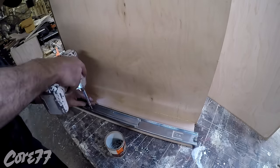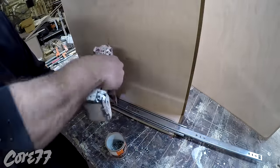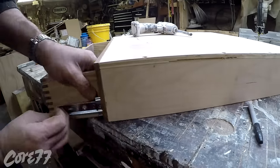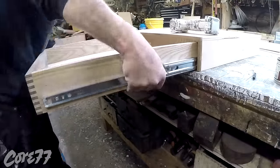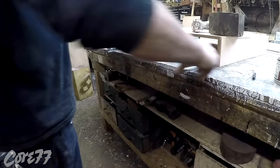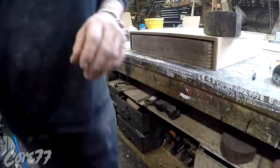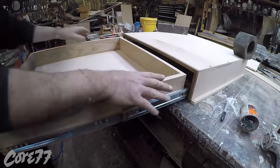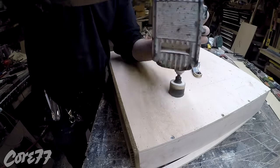The sliders go in there and I'm using most of the available screw holes. I see these drawers fail a lot because people only use two screw holes on either side of the sliders. I have the drawer positioned inside its box so it's easy to put the sliders on the drawer. I put as many screws as I can, then remove the drawer completely from the rails — I call them sliders and rails interchangeably. I wanted the rails tucked back so you don't see them right at the front of the drawer. This is my workshop — I am the client here.